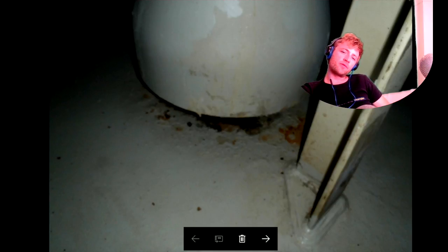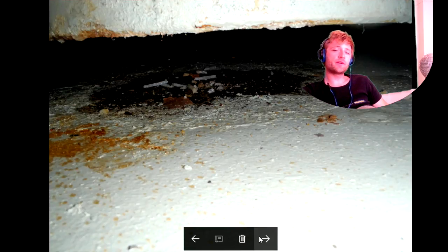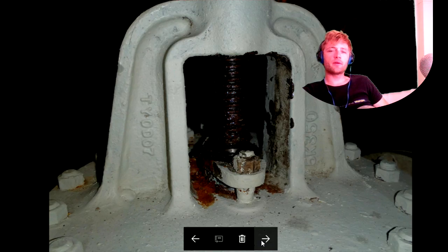That's why be careful to keep your bilges clean. Here there is some salt — we check if you have any leakages. We open the valve to see if water is coming. This is a non-return valve — we check it and then close again.